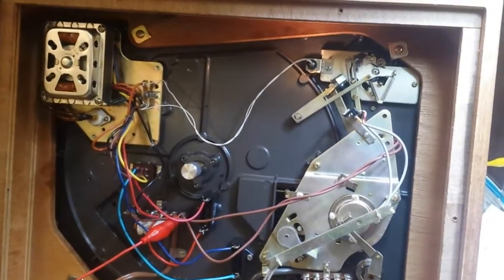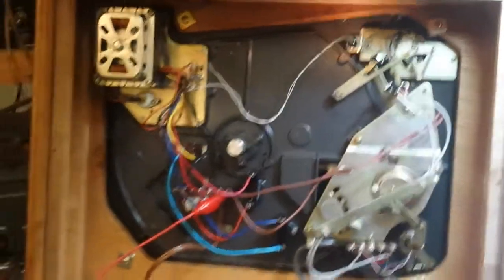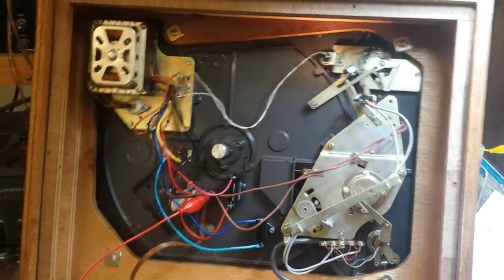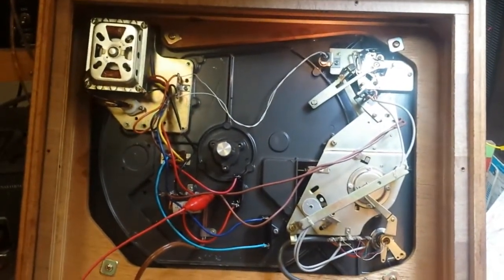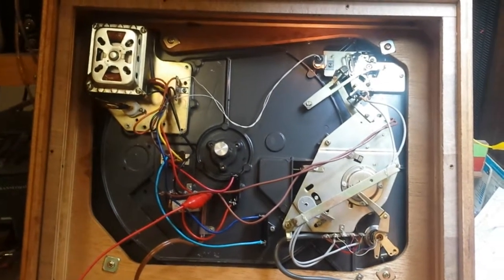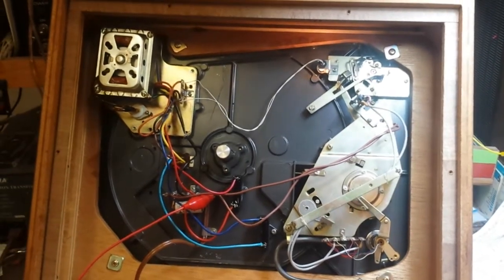It may be that later on, both sets of coils will need phasing capacitors to help clean it up. But for now, that will at least preserve this machine and cause it to run a little bit longer. Hope this is useful to you — I haven't tried this with Garrard's yet, but it seems to be very successful with Pioneer's. Thanks for watching, more stuff to come soon.